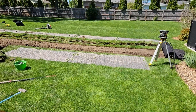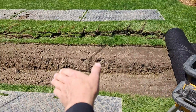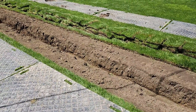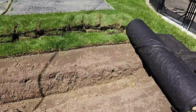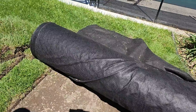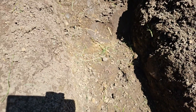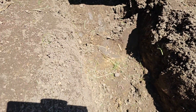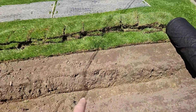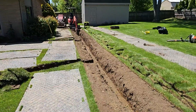In order to catch that water and not allow it to come all the way to the back patio, we have to hang water up. To hang water up, you have to create a low point — a soft swale. Water always finds the low points. Another thing everyone wants to know: how deep do you start your trench? This is a perfect example. The guys are barely deep enough to bury a four-inch pipe — no more than ten inches. That way they can create more slope at the bottom of the trench by getting deeper, because this is all level going this way.